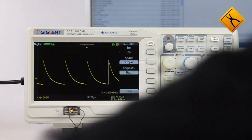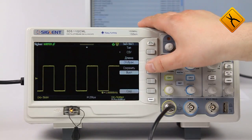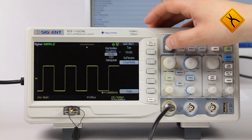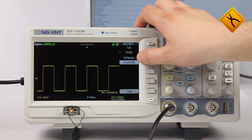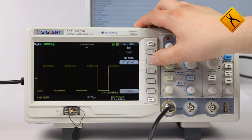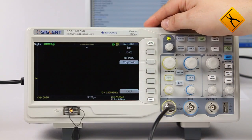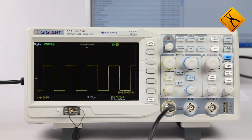There is a method which greatly simplifies the saving process. The Print button may not only send waveforms to a printer, but can also be used to quickly save data to external memory in a selected format. The waveform must be saved in BMP format for printing. After the appropriate settings are made, waveform saving is performed by pressing a single button.